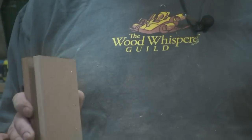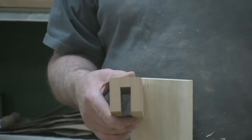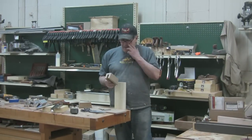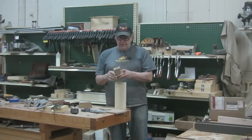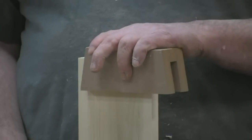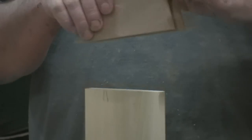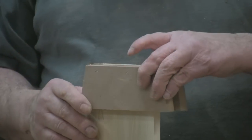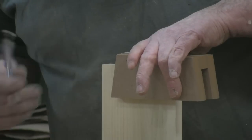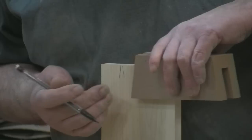This is high dollar. This is expensive. This is a little bit of MDF, a few staples, screws, a little bit of glue, no matter. What I did, you can see what it is. All it is, the centerpiece of MDF matches the thickness of my wood. Okay? And you notice it's cut on an angle this way and this way, to the angle I want. So I can go in here and do what I just did, or I can just simply sit here and go zip, zip.